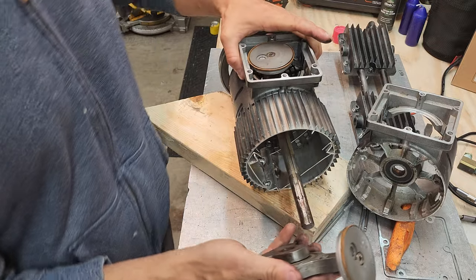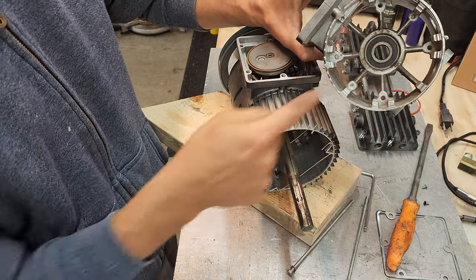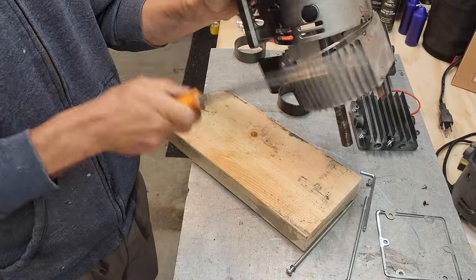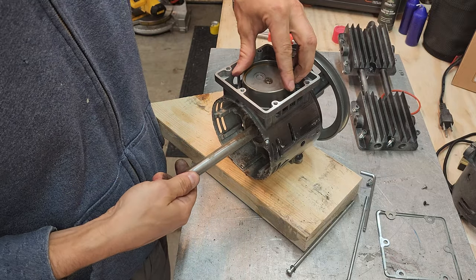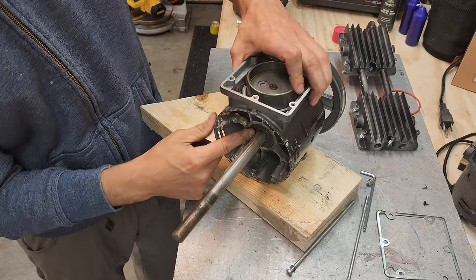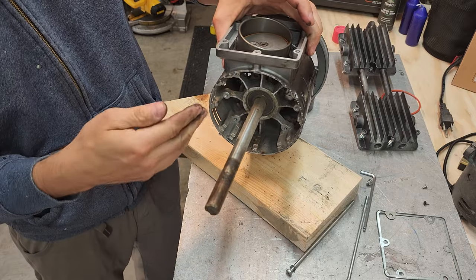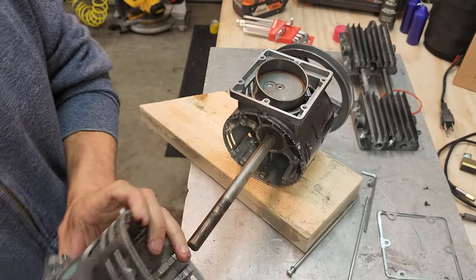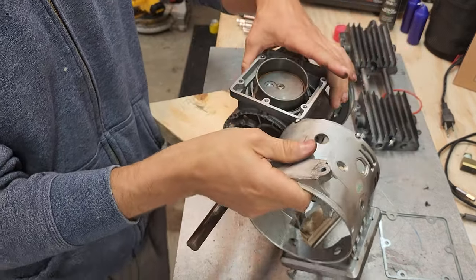Let's say I can run this on a single piston. Is there a way that I could just remove this part, slide this right up tight, and then this bearing would actually be supporting this end of the shaft still? Right here is just a single piston, happily going about its business. You've got all this extra shaft here, but there's a single bearing. You wouldn't want to just run a pulley on that with a single bearing — it's too much torque. But I can slide this all the way tight, cut off the excess, and have a much more compact setup, still a perfectly good cylinder.